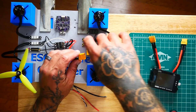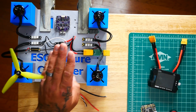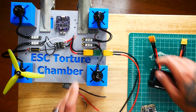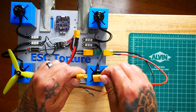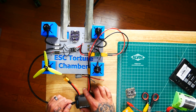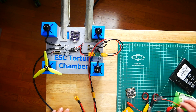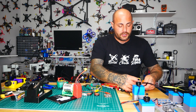The very first thing I need to do is plug in the ESC. She's wired up to the motor and wired up to the power. I've built an extension to help me get back a little bit, so we're going to plug that in, then plug it into the meter. Lastly, we are going to take our signal connection — this is not going to give it Dshot or Oneshot, it's just going to be a PWM signal. We are locked and loaded. Turn this all the way up, set the battery aside, and let's begin the torture session.